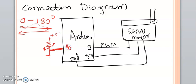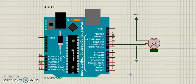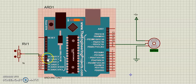The analog voltage at A0 is going to be converted to its digital value — we have seen how that conversion happens in our last practicals. So why not combine this with the servo motor practical? Here I need to connect a 1k potentiometer at pin number A0.